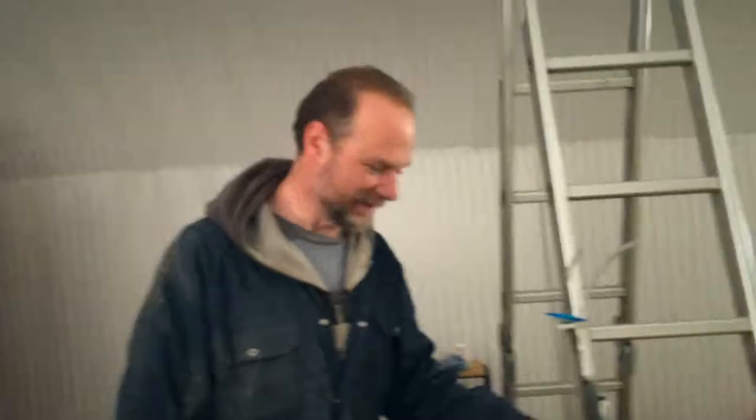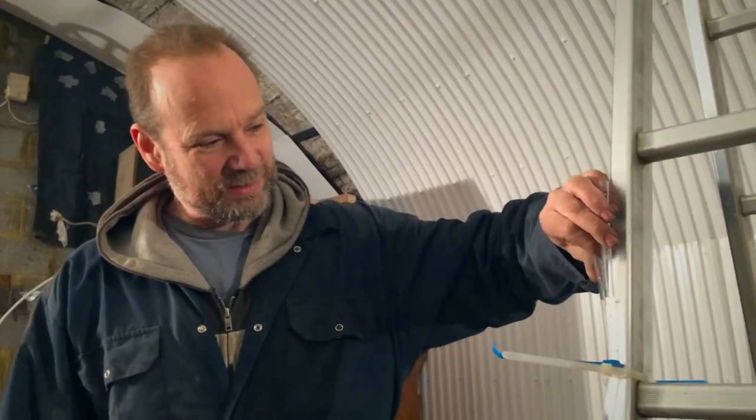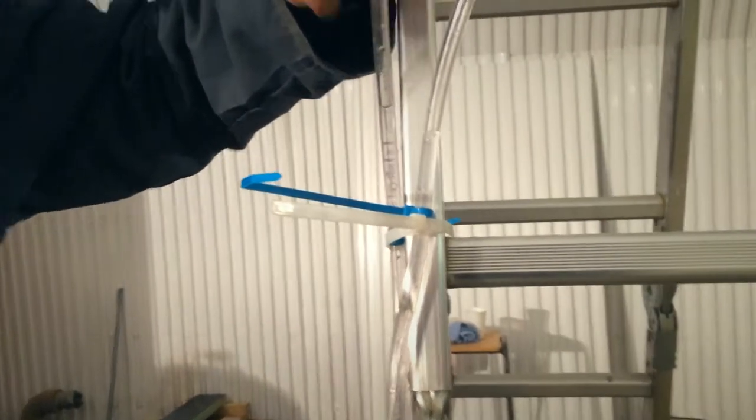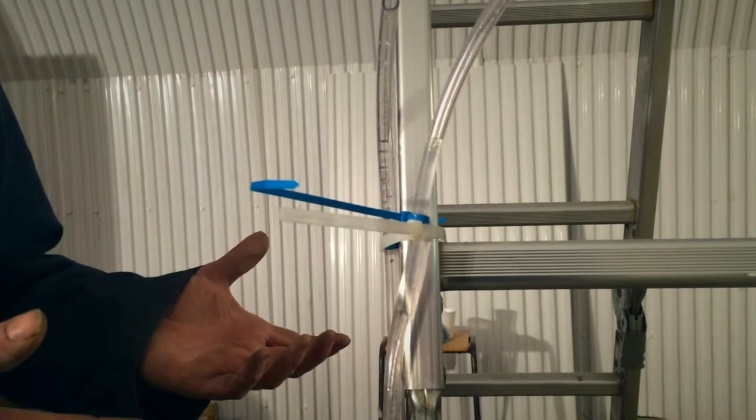We set up the water level again. We had a lot of fun trying to get this bit of ancient technology going, where we fill the hose up with water - it took ages to get all the bubbles out. When we've got that spread out, we'll know one end of the room wherever the water level is, it will match the other end. It's a really good way of finding a level. We'll level the floor up using that, space it up, get mortar under it, drop the whole floor down, and it'll be ready for putting some tongue and groove boards on.